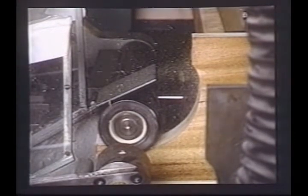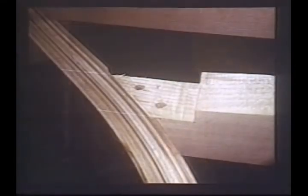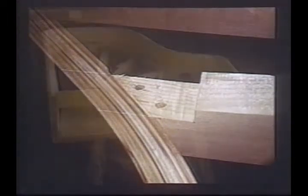On the front ends of the rim, we shape our distinctively formed piano arms. Doweling is a part of good woodworking. Looking at the piano upside down, we can see the bracing on the underside glued to the rim. Then we drill holes and drive maple dowels through the brace into the rim to lock it in position. The same is done on the top side of the brace rim juncture to form a perfectly cross-locked joint. You'll notice there are no metal connectors to distort the sound or weaken the construction.